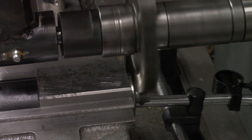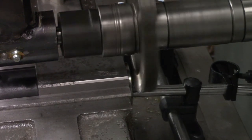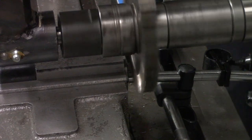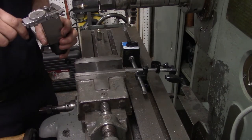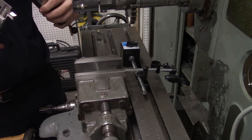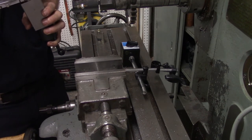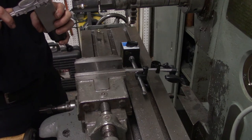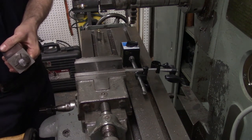I started at 17.32 and I should be 110 thousandths away from my goal — and yes I am, I'm at 4-22. So when I take another 110 thousandths off of this side, we'll be right there on 5/16ths.